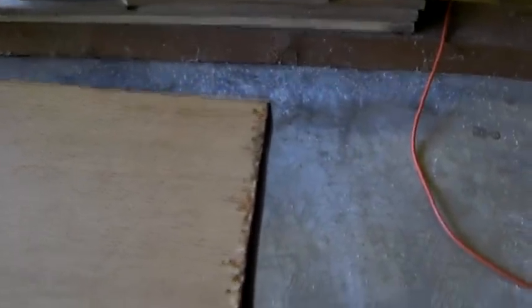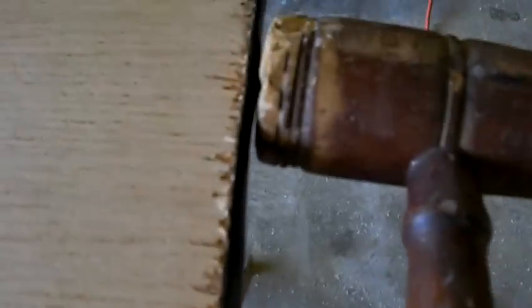You don't want to hit real hard — it'll leave a nasty mark on the outside of the T-mold. You can see how this is kind of swelling out a little bit right there, flat at the corner and then swelling out. That's just because I haven't pushed it all the way in yet. When you're done, you can go back to any raised spots and give a little tap with a wooden mallet — something that's not going to leave a mark on your T-mold.